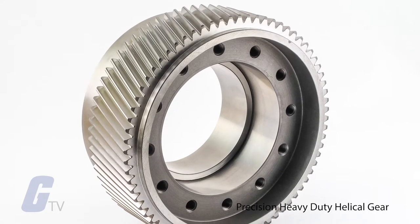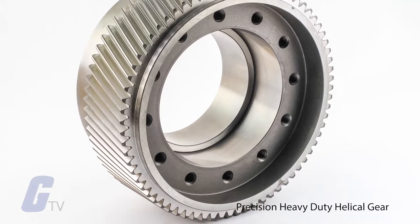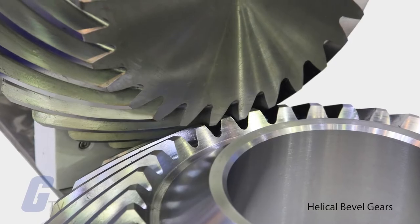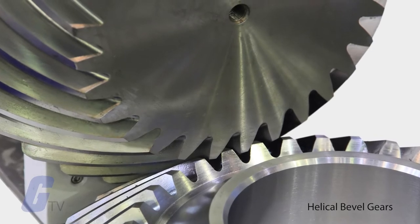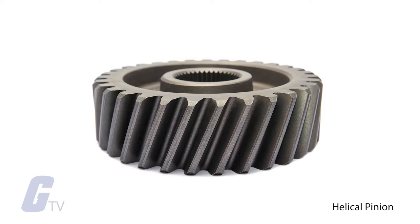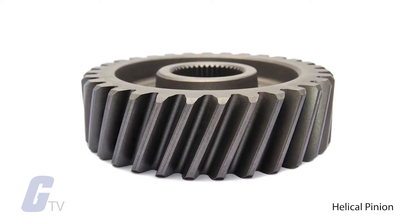The next type of gear is known as a helical or dry fixed gear, and they can be thought of as a refined version of a spur gear. The leading edges of the teeth on helical gears are not parallel to the axis of rotation but are instead set at an angle. This curve makes the tooth shape a segment of a helix shape, and these gears can be meshed in parallel or crossed orientations.